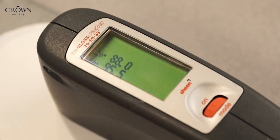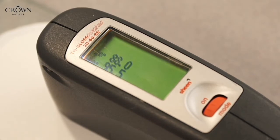This is the fast flow gloss. So we're typically getting a gloss value of 88 gloss units at 20 degrees, which is the sort of levels you get for a traditional solvent-based gloss paint. The satins, it's tested in the same way. We'll draw it down on the piece of glass, but we've got a lower specification to match to than a gloss paint, obviously, because it's less reflective for the light. We match our fast flow satins to a traditional solvent-based satin finish.